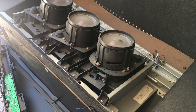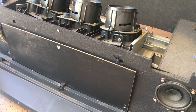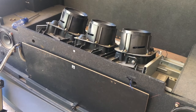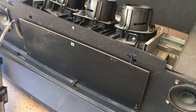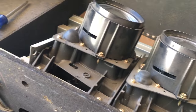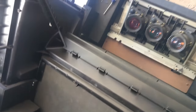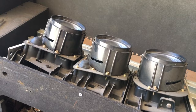Here's a closer look at the three lenses on our three CRTs. You can see there is a very thick layer of dust on these. We have three very high-power CRTs, and they are very bright for their size. Each one of them has one of the primary colors — red, green, and blue. We can take a closer look at the bottom of the CRTs if we take this panel off. Here you can see the bottoms of the three CRTs. Each one has a special lens assembly. These lenses allow the CRTs to project their images onto this large mirror here, and the three CRT lens assemblies are pointed towards each other so that the red, green, and blue colors combine and make a full color picture.